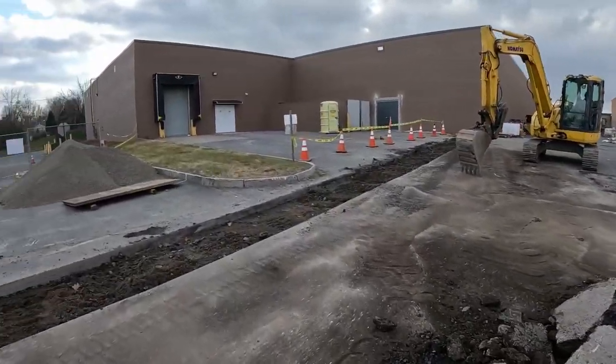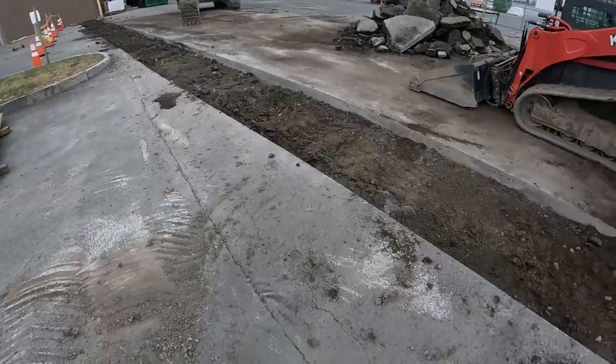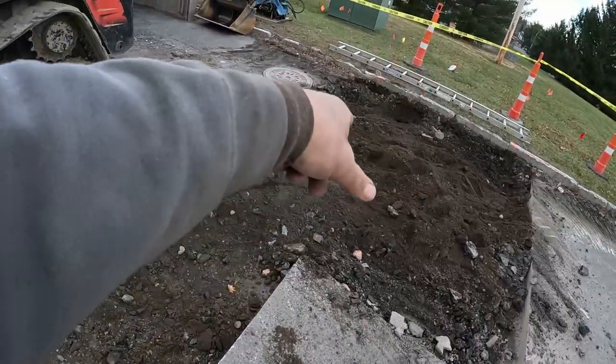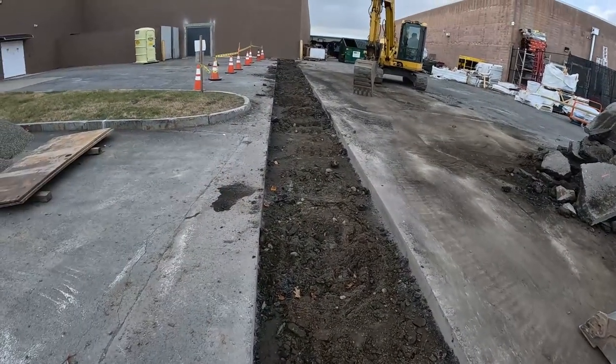I'm gonna load that out tomorrow on a Sunday. This thing will be all ready. This is where we're going down. From this point, here's our water line right here, and it's gonna slope down to the 11 foot down there into the main. It'll taper up. This will only be 4 foot the rest of the way, which ain't bad.